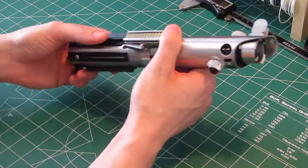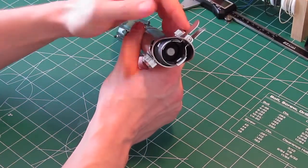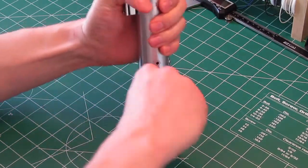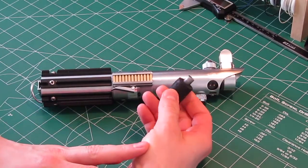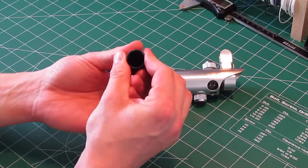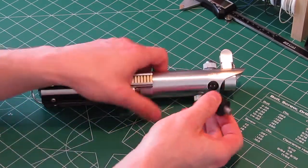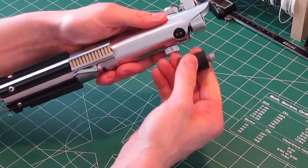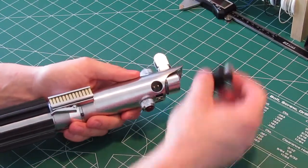Up here I actually designed my own blade plug. This is a part I made on my computer and had Shapeways print out. It's nothing complicated — I just wanted something really simple that would be durable and hold up. It's very strong and tough. It does flex a bit, but you can apply some pretty solid pressure and it's not going to crack. The blade thumb screw is right here, and this has got to stand up to being tightened down again and again, which it will.